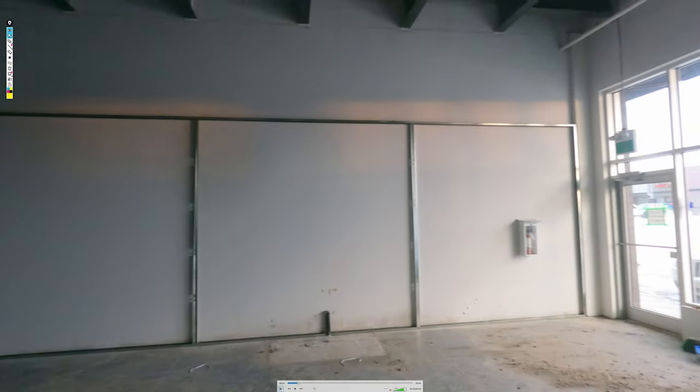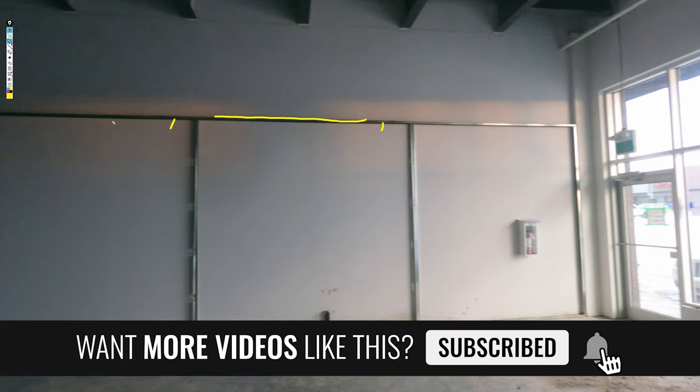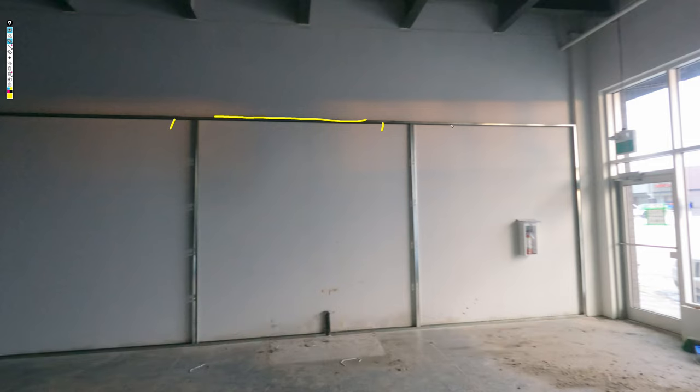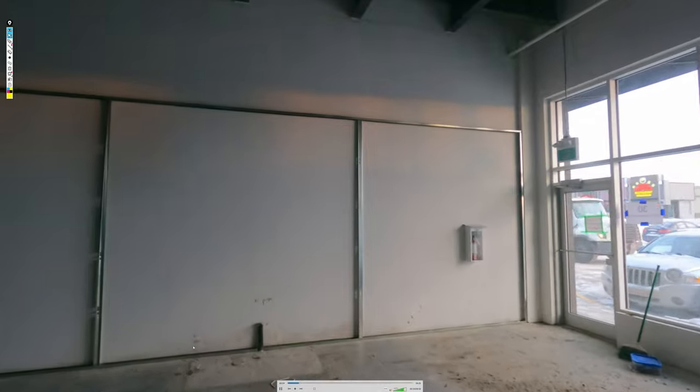This right here is the way that we do these furring walls. This track that you see here is just screwed into the wall at elevation. Then we do the whole run, and we don't have to cut our studs. They're 12-foot studs. We go 12-foot half-inch, screw this track in, and then we pin down the bottom track. We screw this end stud into the wall, and then it's just filling it in after. So it's pretty easy. Nothing complicated there. Just keep that in mind.